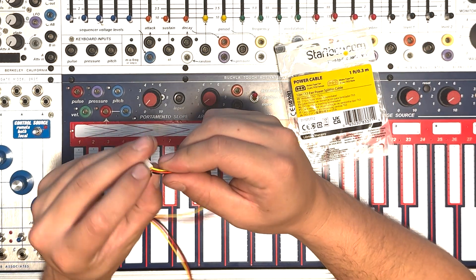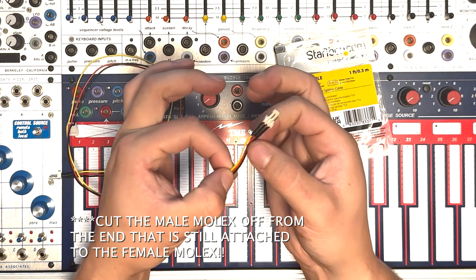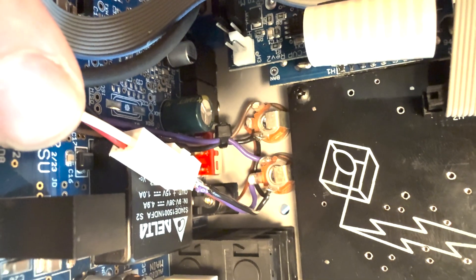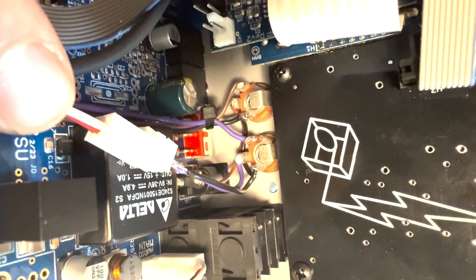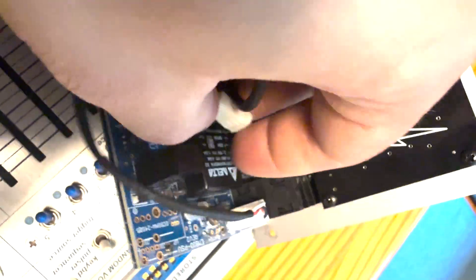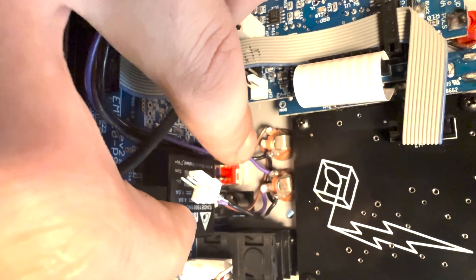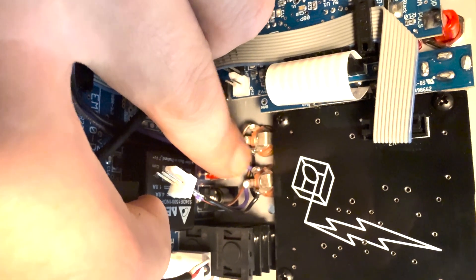What we're going to do is leave one of the splits and cut the other three flush, then cut about an inch back from here because we want an inch extra of black wire. Then we solder it up. I'll put a close-up in the video that explains the soldering. The ground coming in from the male Molex is going to the ground pin on these jacks. The audio coming from the 208C on the male Molex is going to the shunt pin, which is the middle pin. The output pin is on the left, so make sure you orient your pins correctly — and it's the same for both channels.